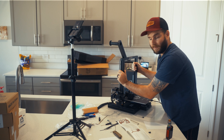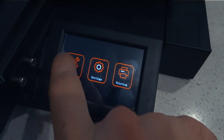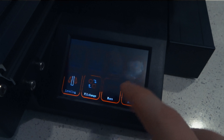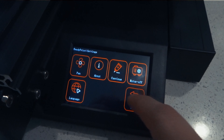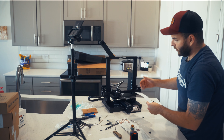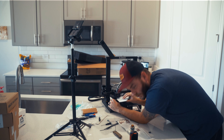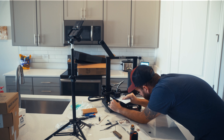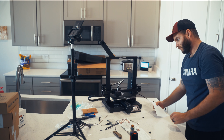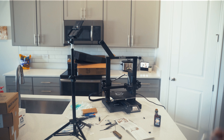What we're doing right now is we're going to level it. So on the touch screen we can select all the points. We'll get into the menu system in a little bit. We're going to go to point one on the leveling. The manual is not really great on telling you how close is too close. We've already gone through leveling once. Put the paper under here - you want to level it because every time you level it it's going to change. I was just stopping it when I get a little bit of resistance - I can still move the paper but I'm getting resistance from it. We'll continue through a few points until we get good active resistance on all of them.